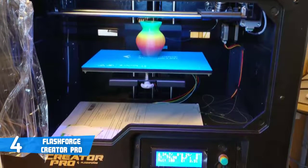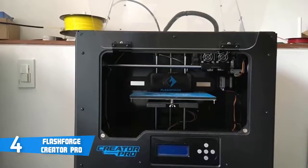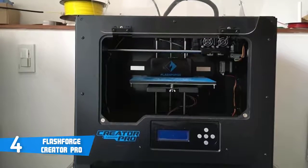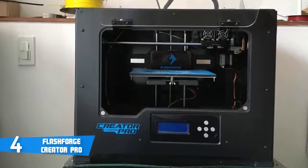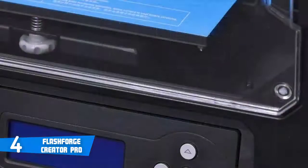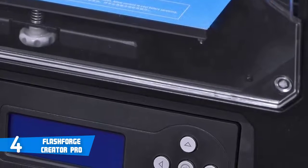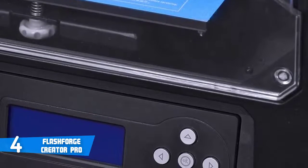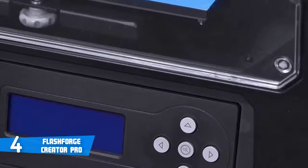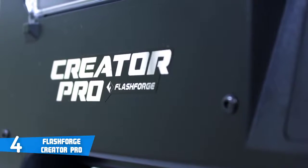In addition, the heated bed allows you to print ABS filament with minimal warping, depending on how well you leveled your bed, which can heat up to 130 degrees Celsius. To be more specific, the extruders can also reach high temperatures up to 280 degrees Celsius, which allows you to use a large variety of materials. The FlashForge also comes with a blueprint bed sticker, so when you have leveled your bed correctly, PLA and ABS materials stick very well to the blue sticker on the bed.